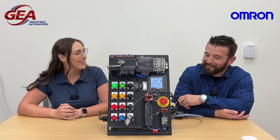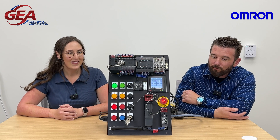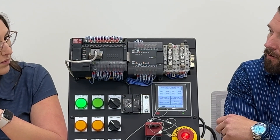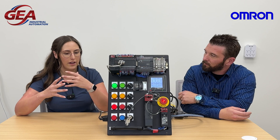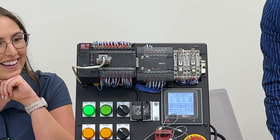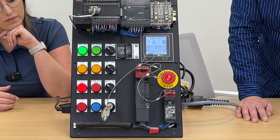It's basically a lot of the safety components that Omron provides. Starting from the top, the G9SP is a safety controller — a standalone controller. Safety controllers are their own category for redundancy and everything that goes on within them. Next to the controller we have some extra I/O, some force-guided relays, pilot devices, and safety interlocks.